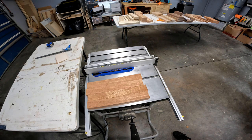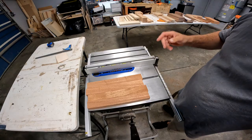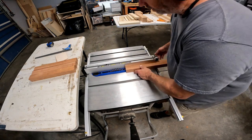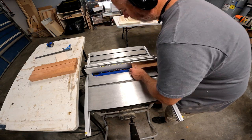I'm starting with my deep cut first and then I'm going to work my way out. This should take about two blade cuts. I'm going to go back, adjust my fence in, line my boards back up, and run them through again.